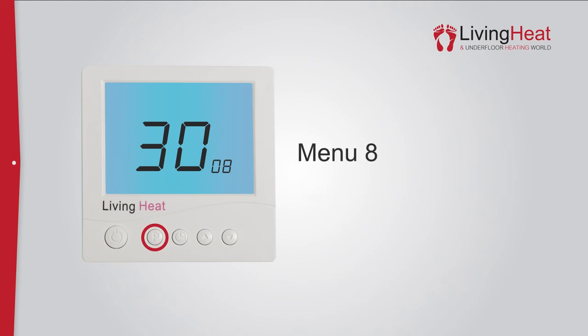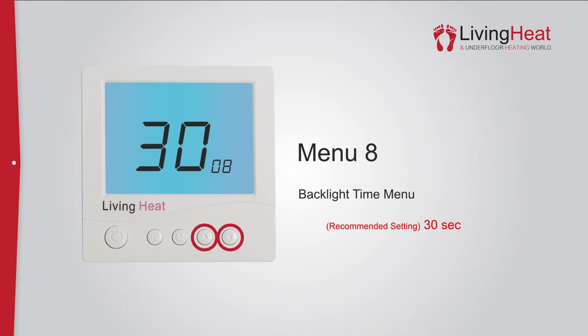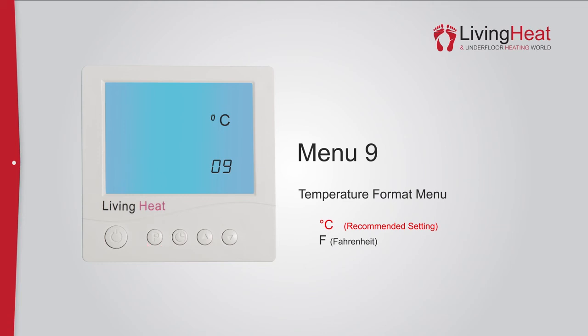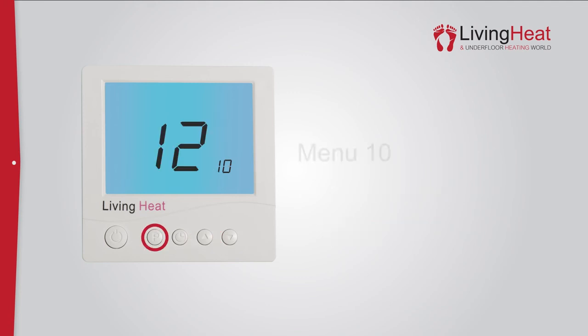Menu 8 is the backlight time setting. This allows the user to select how long they would like the thermostat to stay illuminated after any key has been pressed. Use the up and down arrows to select your desired setting, and then press the P button to move on to Menu 9. Menu 9 is Temperature Format Setting. This thermostat can display either degrees centigrade or degrees Fahrenheit. Use the up and down arrows to select your desired setting, and then press the P button to move on to Menu 10.